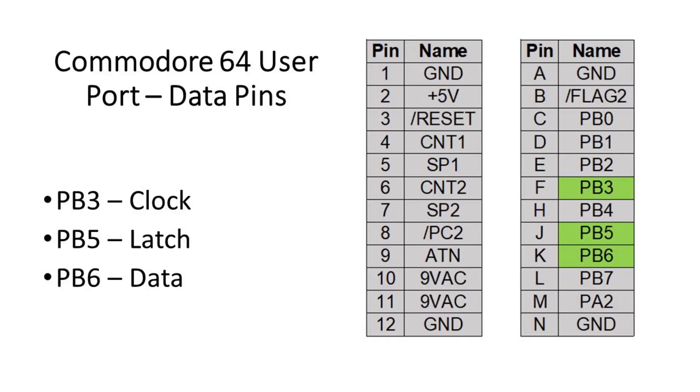And there they are! It may look a little odd, but it will make more sense in a minute. It's beyond the scope of this video, but you would only really need to set the latch pin, then pulse the clock pin low then high 16 times. Each time you did this, one bit of the data would be available on the data output.